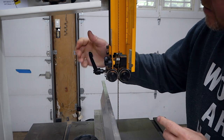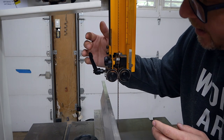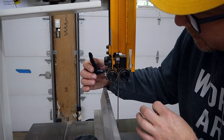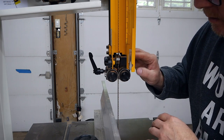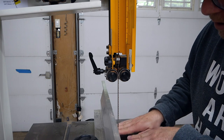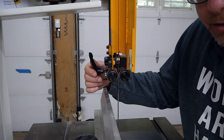When you couple this with the kind of loose nature of the arm when it's not locked in, it makes the machine a little bit delicate at times. I have noticed that as long as you get the thrust bearing block and the guide bearing block parallel to the tabletop and locked into place, you generally don't need to move it.